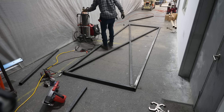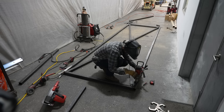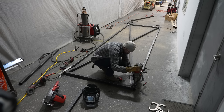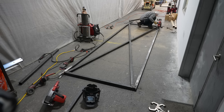With the door welded up I could drill for my plug welds for my hinges, and again I'm using this mag drill. The cordless nature of this mag drill just makes it so versatile — it's honestly one of the more expensive tools I've bought for myself, but it has made its money back time and time again. Two 5/8-inch plug weld holes in each of these tubes will allow me to weld in both of the hinges once everything is all set.